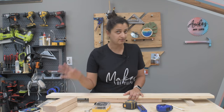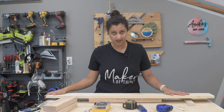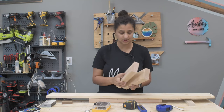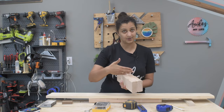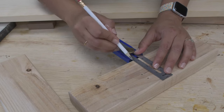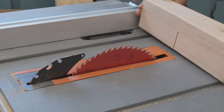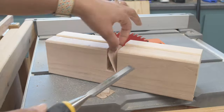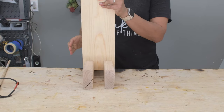I'm not quite sure if the idea is going to work or if it's going to be stable enough, but here's what I'm thinking. I have a 1x6 board which is about 4 feet wide and some 2x4s left over, cut down to 12 inches each. I'm going to make a slot so the board stands up on that. I measured and marked the 2x4s for the slot and took them to my table saw — basically exactly how you would do half lap cuts with multiple passes. You could also use a jigsaw. That is the slot, and I tried it out with the scoreboard board and it works.